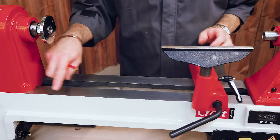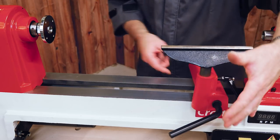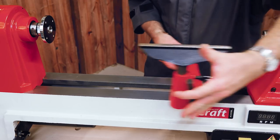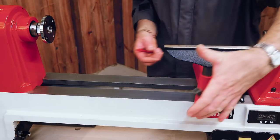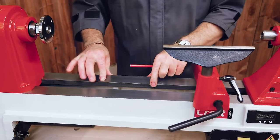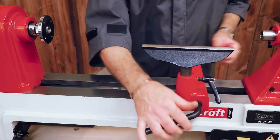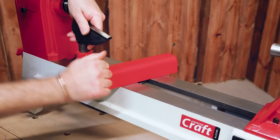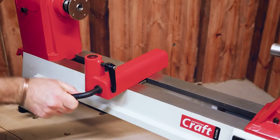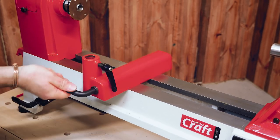The bed has a ground surface finish which is then brush finished, so it's smoother than just leaving the ground surface. With just the ground finish things tend to drag a bit, but undo the banjo and it slides nice and evenly — nice even thickness, no sharp corners. Everything's been done to make this easy to use. The banjo has a cast iron cam lock lever: push down and it locks in place nicely, easy to move along one-handed.